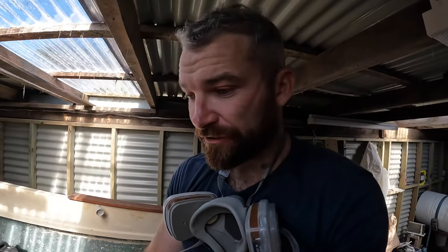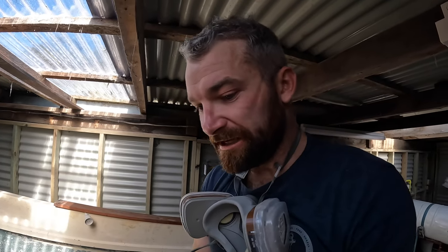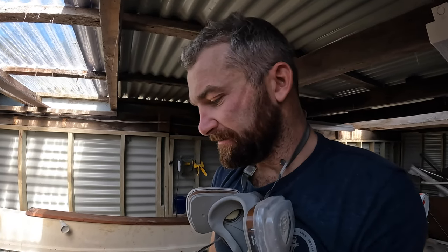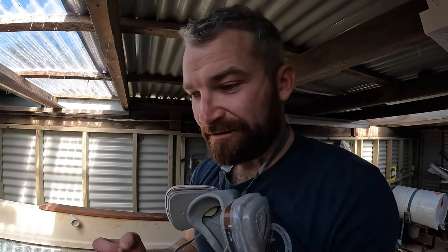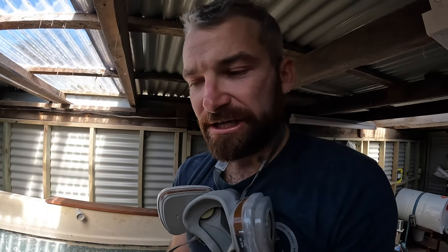You'll notice that I did put some screws in the floor on those outside stringers. Now, the reason for that is I did change my mind yesterday when I did screw the other floor down in a few sections as well, just because I really wanted it to pull down and stay snug there for that glue to really bond well. So I wasn't going to rely on the weight alone. So I punched some screws in, and the intention is I'll probably pull those screws out. They're only 304 stainless, so I'll probably pull those out and replace them with some 316 stainless, maybe a little bit heavier gauge, a little bit wider head on it, and that'll sandwich into the Thermolite.